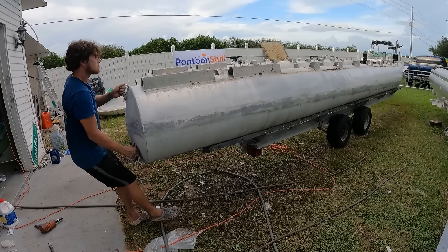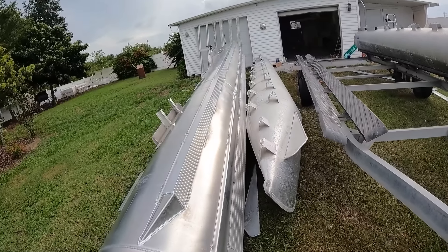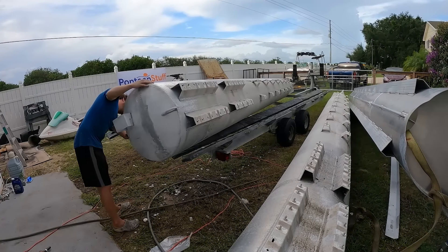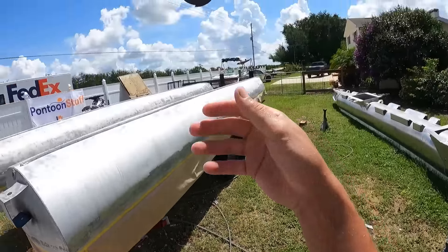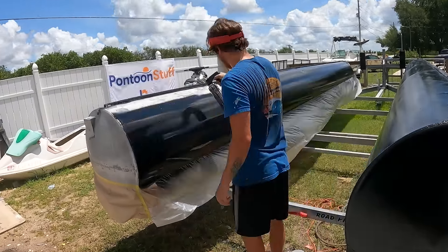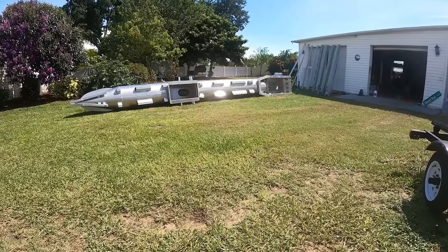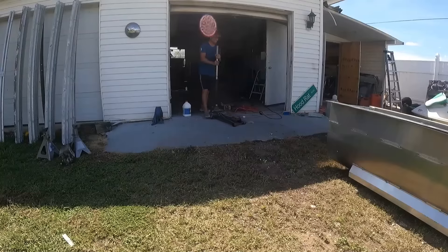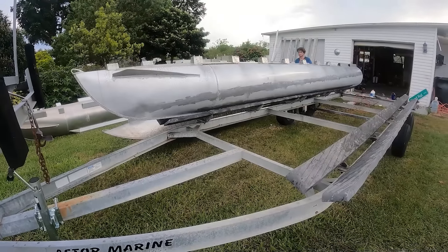The outer pontoons aren't really that heavy, but the center pontoon is very heavy — had to move it with the mower and everything. I follow a couple pages on Facebook: Pontoon Junkies is one, Ghetto Pontoons is another. Those are both good sites if you have a pontoon rebuild and you're looking for parts or advice. I saw someone recommend using Rust-Oleum spray paint to paint your pontoons and decided to test it out, because that's what I like doing on my channel — test stuff out, try to save you guys some money. The paint was around $100, and the other material was another $50, so $150 for painting pontoons is pretty cheap, and it's held up pretty well. I've had this pontoon for almost a year now, a couple months of using it, and the paint is still in great shape. I just use it on a lake, but the paint holds up very well — I'm pretty impressed.